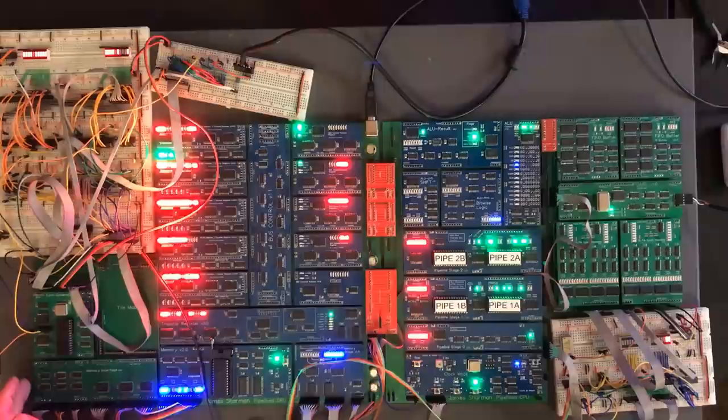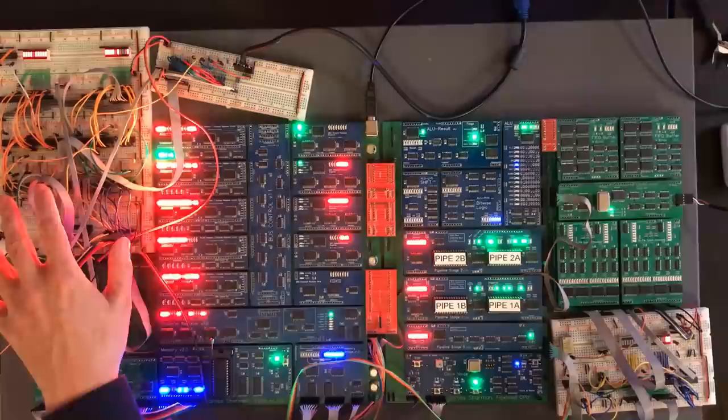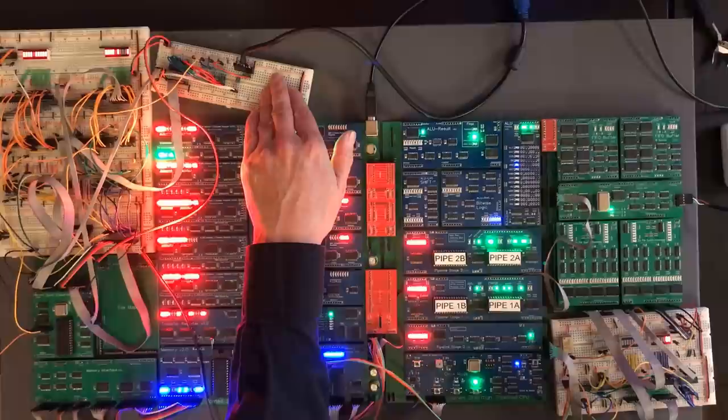Okay, so we've got two modules of the VGA converted into PCB. We've got the interface, which handles connecting everything to the main memory system. We've also got the sync generator, but the tile map is still breadboard. We've got the output DAC, but that's a very temporary circuit at the moment. We're going to be working on that significantly later on. But this is ready to be converted.